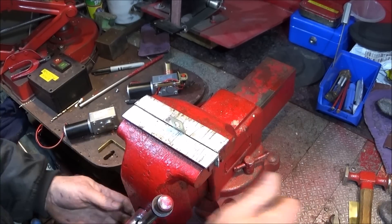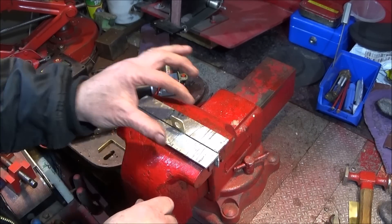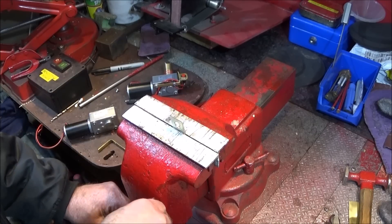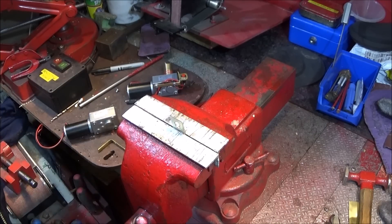I use my panel bead hammer to tidy that up so it's a nice right angle down onto this 1/8 brass, and that ensures that when it goes on to the gearbox there's a gap between the front of the gearbox and the brass plate. I've marked that one up to bend over at a right angle as well, so get it nice and square in the vise. Before you do all this bending work, make sure you buff up the brass and make sure it's nice and clean ready for soldering.